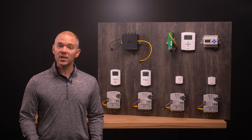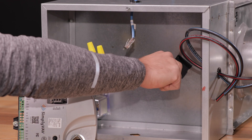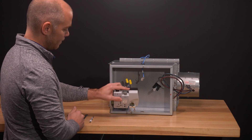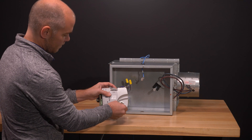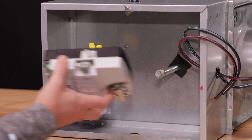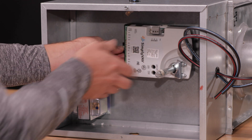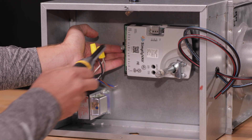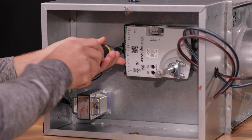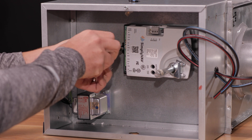Let's start by installing the Simply VAV controller in a VAV terminal box. First, manually position the damper in the fully open position. Next, press the gear disengagement button and rotate the V-bolt in the same direction as the damper until the V-bolt is against the stop. Place the controller over the damper shaft, positioning it so the anti-rotation bushing is free from obstruction and can move freely in the mounting tab. Center the bushing in the slot and fasten the controller with a number 8 sheet metal screw.